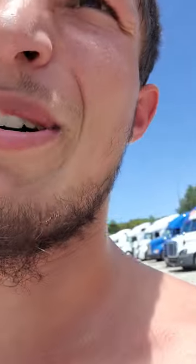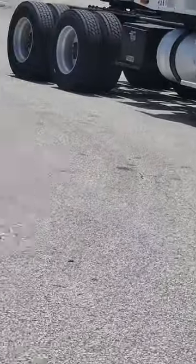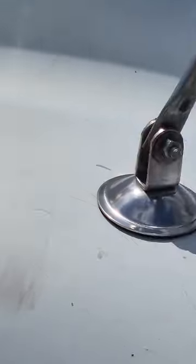Remember the 9/16 and the drain cock? The 9/16 drive ratchet and the drain cock. Yep. The bleeder tube. Not the same bleeder to prime up a big truck with no ether, because it's bad, and put fuel in the fuel filter. Not that drain cock. The coolant drain cock. Google it. Everything's on Google. You gotta take a 9/16 and open up the coolant drain cock there and drain it, and then put Blue Devil and then put antifreeze, and do this all with a motor not running. I repeat, a cold engine with cold water.